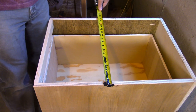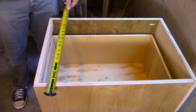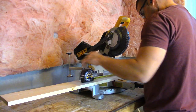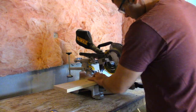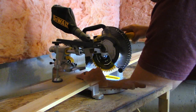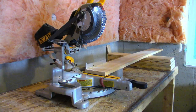I just go ahead and double-check — take three measurements of the top just to make sure that the box stayed square during assembly. Next, I move over to the chop saw and cut out the five pieces to length, finishing up the cuts for the top and the drawer fronts before glue-up.